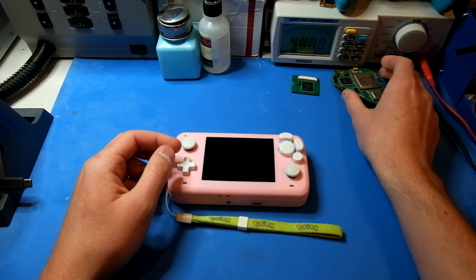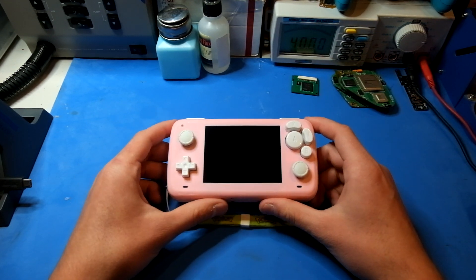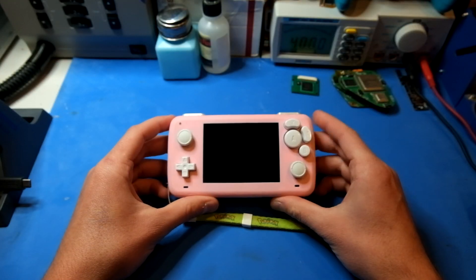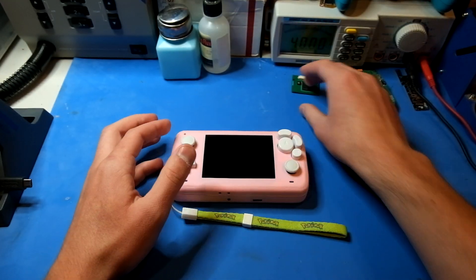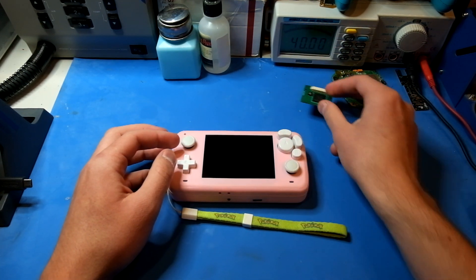Inside it has an Omega-trimmed Wii and four 3500mAh 18650 cells. It also has a 3.5-inch 640x480 IPS screen, and it's driven with my friend Aurelio's Direct Drive board, so big thanks to Aurelio for that.